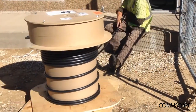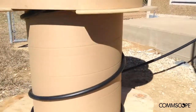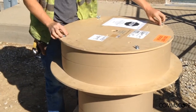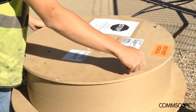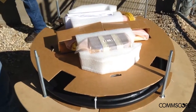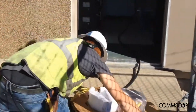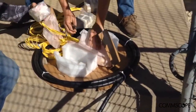Once the cable has been completely pulled off the reel, the contractor can begin unpackaging the cable modules, oftentimes referred to as C-mods. By simply loosening the four wing nuts from the top of the pallet, the top cover can be removed to access the packaged C-mods. The C-mod packaging is designed so that it can be easily removed from the pallet and brought over to an area where unpackaging of the individual C-mods can begin.